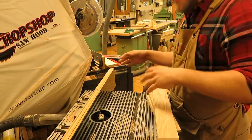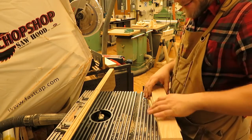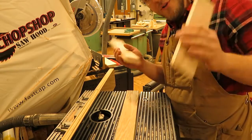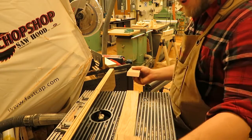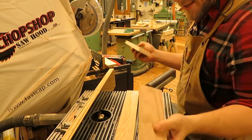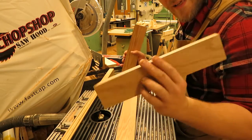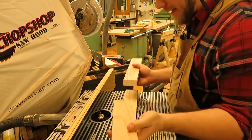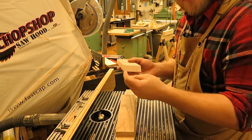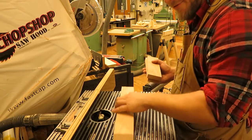Just like the jointer, think of it as always sweeping from right to left as you go across the piece. The order you feed your molding is crucial — if you don't do it on the same edge, you'll end up with two lefts or two rights. The easiest way is to put the pieces together as they'll sit on the box with the edge you want facing up, lay it flat, and that's the order to feed them in. This one goes miter first, this one goes back first.